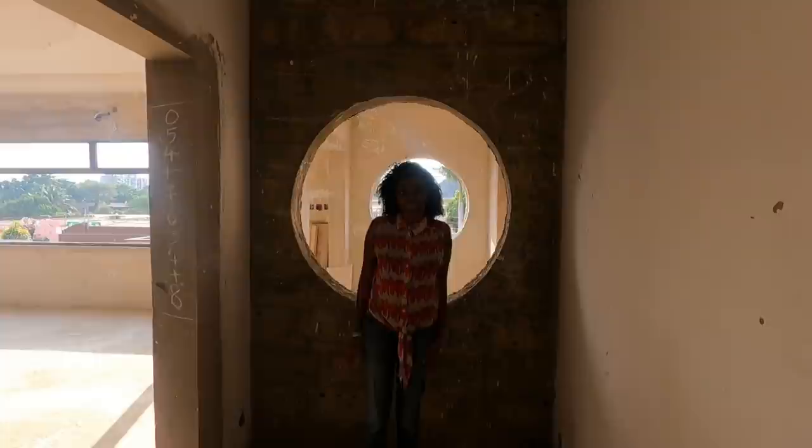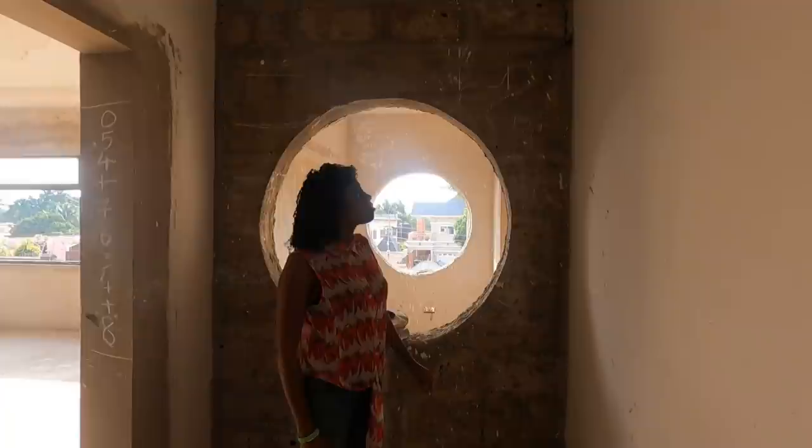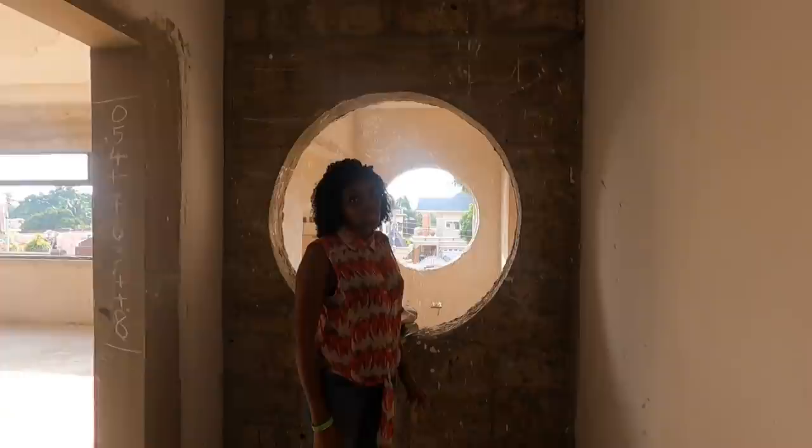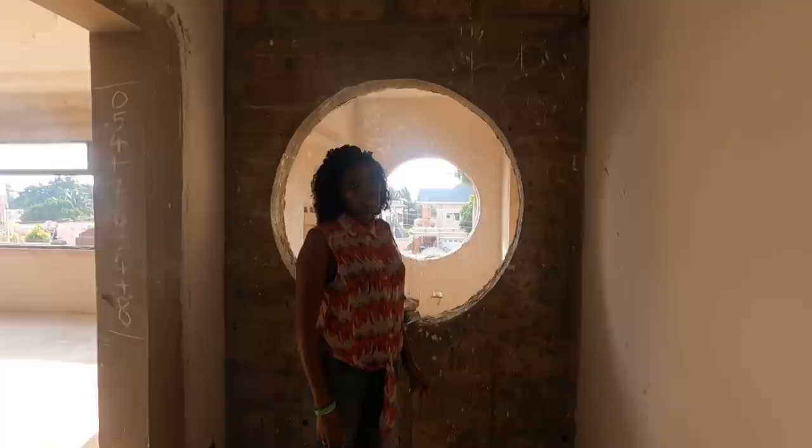Okay, so the dot and dabbing is they'll form a plasterboard out of POP, or we can buy plasterboard. And what they'll use is the POP adhesive, the stuff that they make the plasterboard with, and then they'll literally blob it on the wall, and then they will apply the plasterboard onto that.